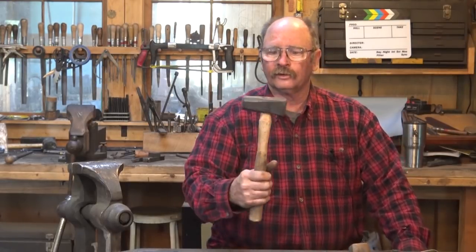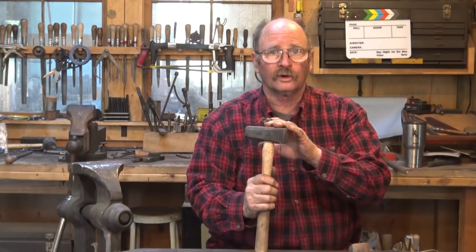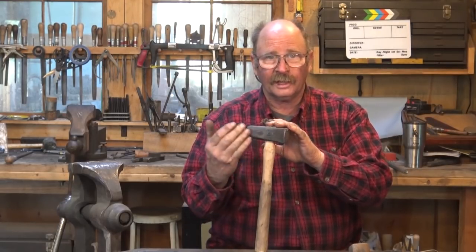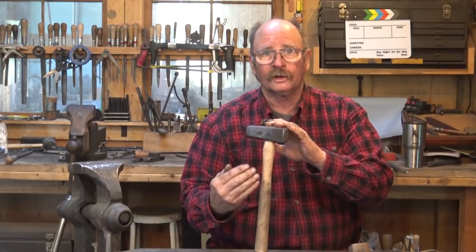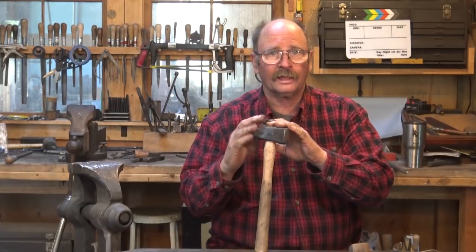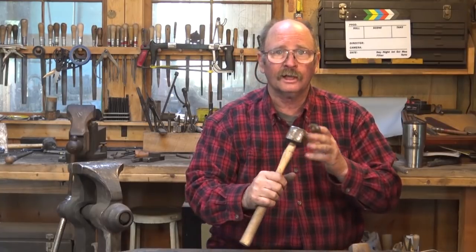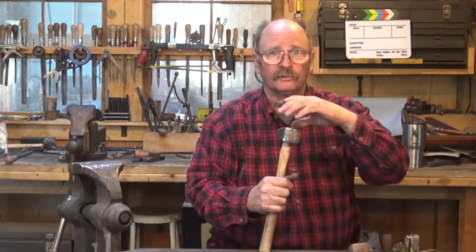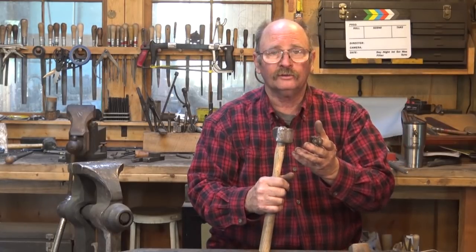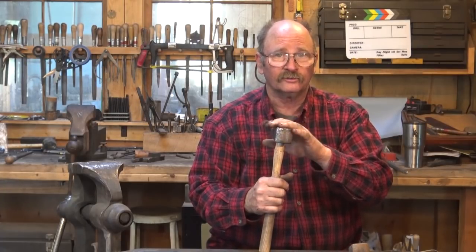Just like with top swedges, it's quite typical for a fuller to have handles that are loose. I tend to wedge mine because I don't work with a striker, and because Colorado's dry weather means my handles are often not still with the tool when I need it. But people who work with a striker all the time prefer handles that are not wedged in place because it transfers less shock to the handle and the person holding it, and you're less likely to break a handle. Plus, in some instances it is beneficial to be able to flip that head around — so if you have a left-sided tool and a right-sided tool, you can get the benefit of both out of one tool without having to make a set.